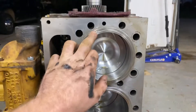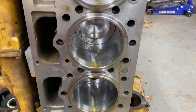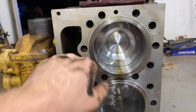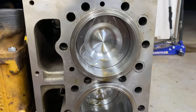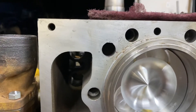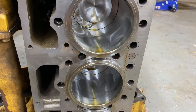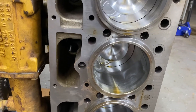After the shims were made, number one and number four went down. I had the block decked. There's a little bit of surface rust — it's been sitting here for a couple weeks. I took a little Brillo pad and you can tell it comes right off.